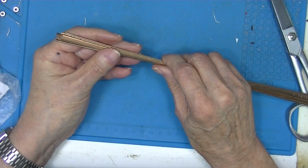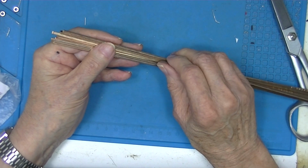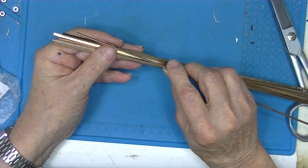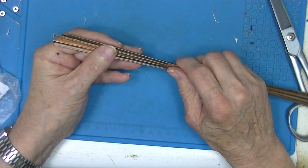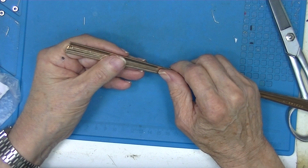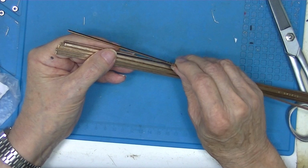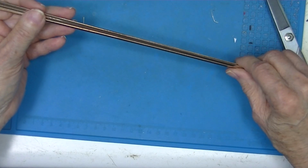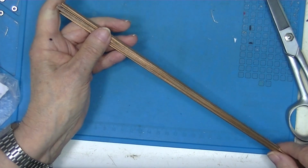handheld single gas torch. What I've used in the past was called Silphos, which is silicon and phosphorus, and it doesn't use brazing or flux, but it needs to have an oxyacetylene torch for this stuff to melt. And you would join two pieces of pipe or a fitting in a pipe, just as you would soft solder for hot and cold water applications. But this stuff is highly resistant to cracking. It's also very expensive. So I'll have to try some of this before I trust that it's what they say it is.